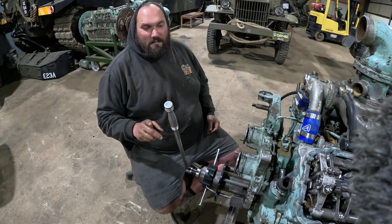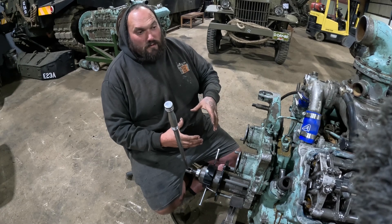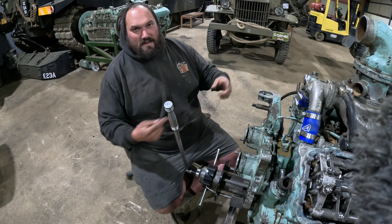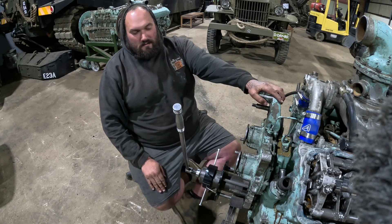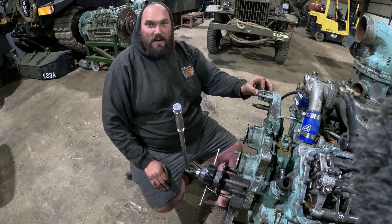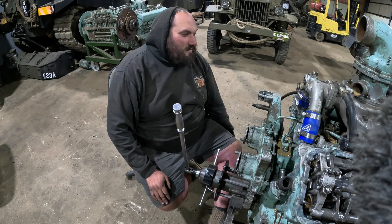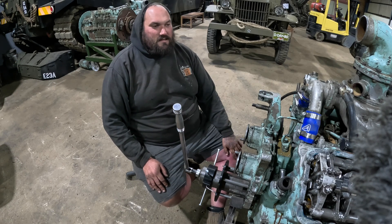What's the point of having two magnetos? A couple of reasons. With a 5.4-inch piston and revving up to 2,400 RPM, you can't burn the petrol efficiently across the piston face. So they needed to ignite it from both sides to get it to burn efficiently. They will run on one magneto out of the two, and that's a bit of redundancy — back when the original engine, the Rolls-Royce Merlin, were up in the sky, you can't pull into a layby. You need to be able to get home again. But it does make a difference — you can tell if you're down a magneto. It is noticeable.